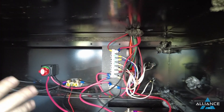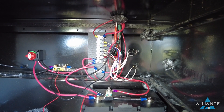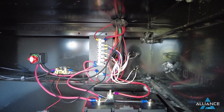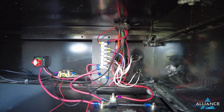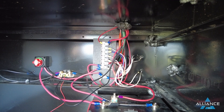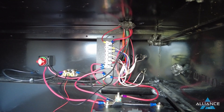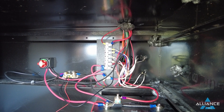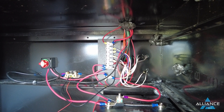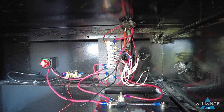After the battery disconnect we come to the stack of mini breakers, which operate some of your heavier-duty systems — slides, tank heaters, etc. A mini breaker is one of these little gray plastic cubes with two posts. It's an automatic resetting circuit breaker: if you exceed — for example — 20 amps of draw, it will trip like a house circuit breaker, but instead of manually resetting it, these automatically reset. If the excess draw continues it will continue to trip, but no manual operation is needed to reset it.